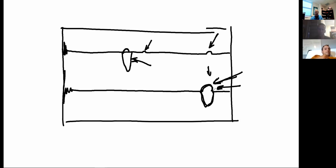All right. Safety is key here. Before I thump cable, what do I tell my fellow employees? Just let them know what you're doing. Exactly. Hey guys, stand in the clear, getting ready to thump. Anybody that's around the transformer is going to stand back. If I've got anybody on the far end waiting, they're going to back away, stand back.